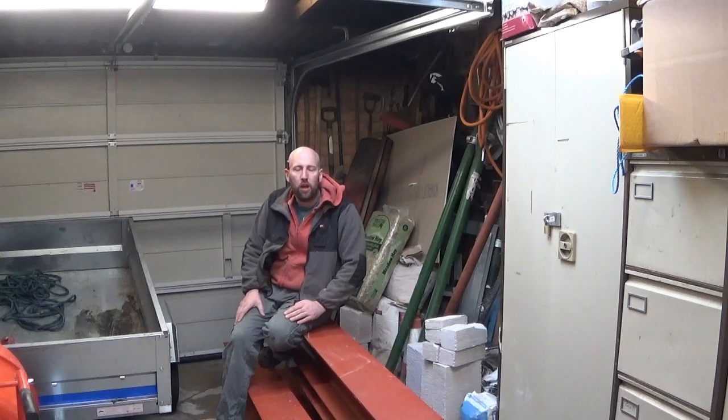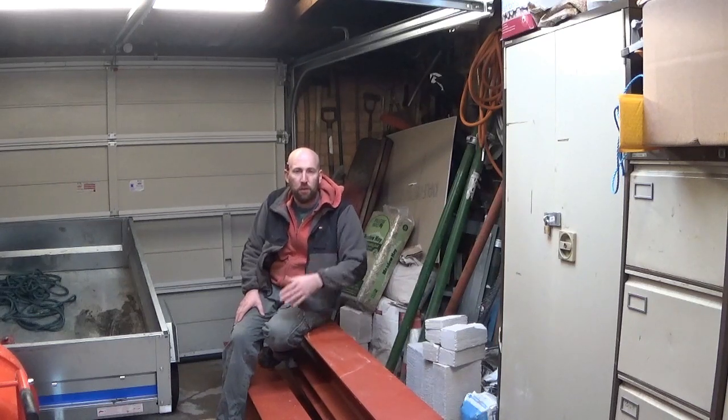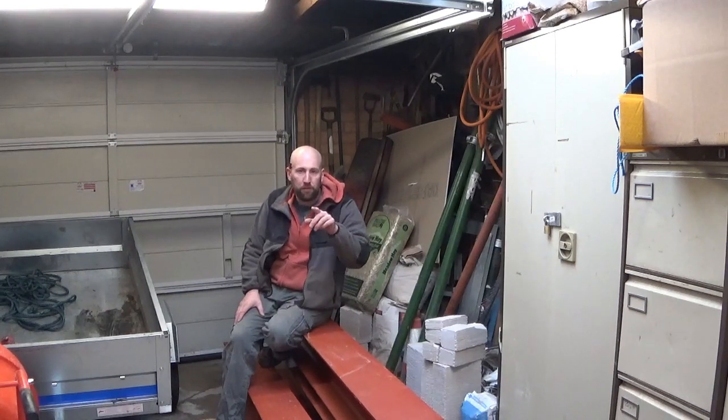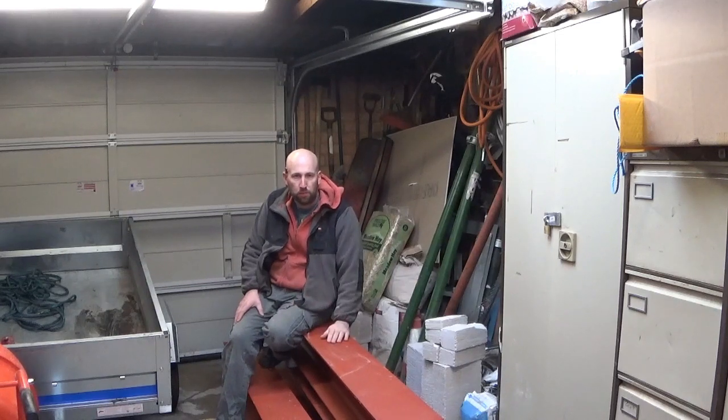First day of the loft conversion. I'm going to make a series of videos, from initially starting out, putting the steelwork in, to full completion. So the day's plan is I'm going to put four pad stones, two at either side, in preparation for these columns going up.